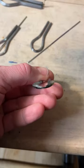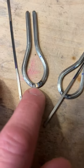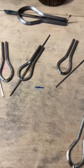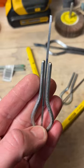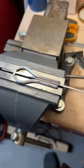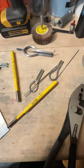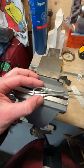My first crimp attempt with this size of keystock was a miserable failure. I don't know if I made the relief cuts a little bit too wide, but what happened was it just smashed down straight and didn't fold over into the channel like I was hoping. So I'm going to put a chisel right into the cut, try to get it started to spread into the middle, and see what happens. I got a successful crimp. Somehow the frame arms got messed up, but I think I might grind that down and make it look nicer. I twanged it and it was pretty clean. I'm going to do the trigger bend and then try the other two. Considering my last crimp was a failure, I'm just going to carry on with this one and see if I can get one to sound good first.